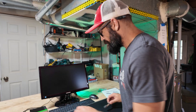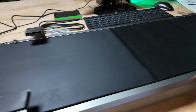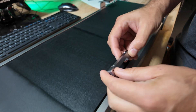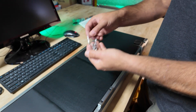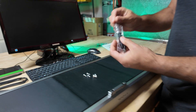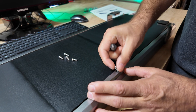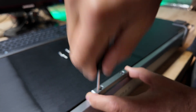We're going to be working with this part right here. We're going to flip this over — there are the two screw holes right here, and they're asking us to put it on this way with these two screw holes facing out according to the diagram. We're just going to put that there, grab a couple of screws — they're all the same size. You don't want to press too hard on the underside; it was not meant to hold any weight. Get these little screws going in — screw one, screw two — make sure it's nice and straight before you crank it down.